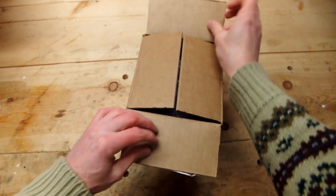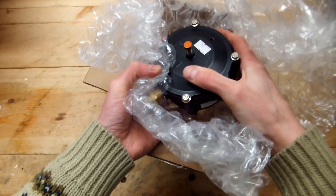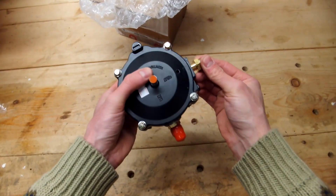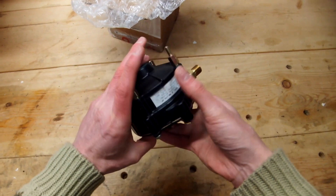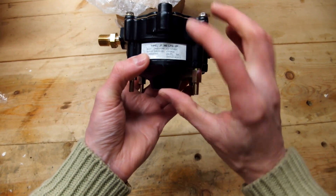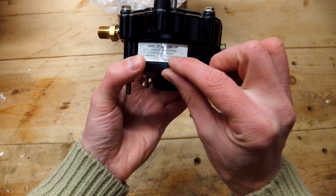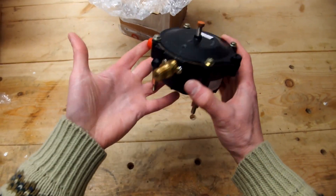This is the regulator, or as JD North America calls it, the decompression valve assembly. It has the inlet for the propane and the outlet that goes to the carburetor. This is the priming button on top of the generator. Underneath it reads: type JF 390 LPG VF, inlet pressure 0.2 to 1 MPa, outlet pressure 0 to approximately 4.8 kPa. Not sure what all that means, but let's install it.